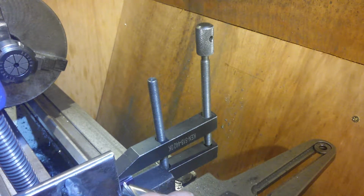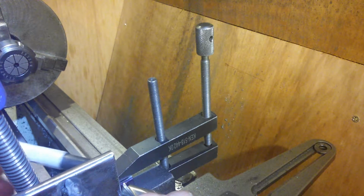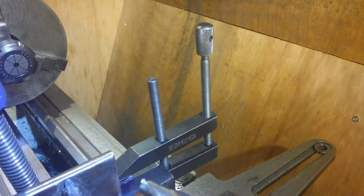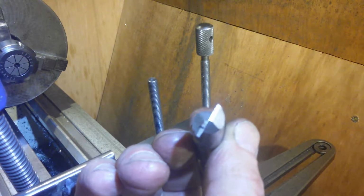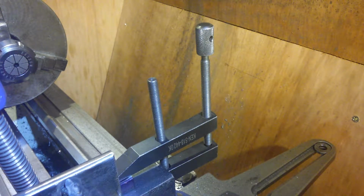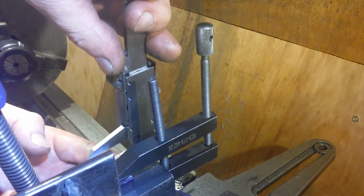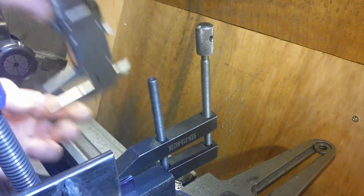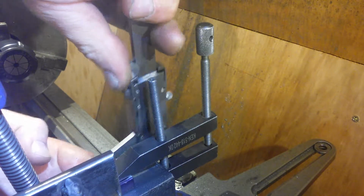This first cut is going to be a complete approximation. So I've got a centre line, and then a sharp mark on it. That looks about right. So I put a sharpie mark on the end of that. You see that? And that's going to be the depth of cut. Let me see what that'll be. And that is just eyeballing for a first cut. 6.8 is the maximum I can take it down to. That is basically 10mm. Measure it again. Yeah, that's basically 10mm.